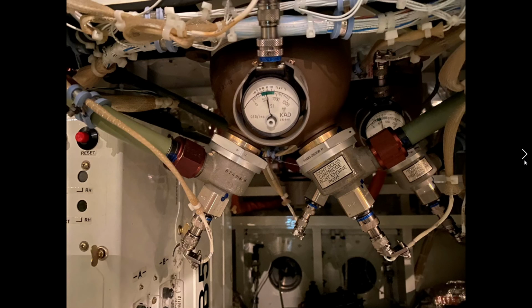Right below the APU equipment bay, losing my words here, are the fire bottles. So there's fire bottle one, fire bottle two, and there's another fire bottle on the top. Each one of these has squibs. So there's a cartridge inside of here, which is electronically fired and releases the halon gas, which is inside here. So as flight crew, we want to make sure that each one of these is at approximately 600 psi